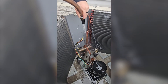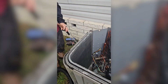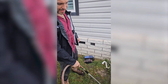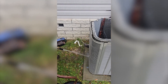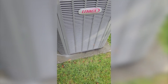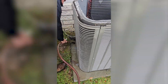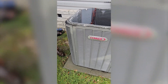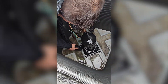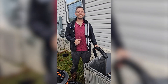Get in the corners — all the leaves and stuff I couldn't get with the vacuum. Then I'll do another sweep of that. I'm also going to hit the pad itself. Different units have the drainage channels in different places, so you want to make sure you spray down the pad to make it look pretty but also to clear out the drainage channels underneath the unit. One more sweep of the vacuum. And that is a clean condenser.